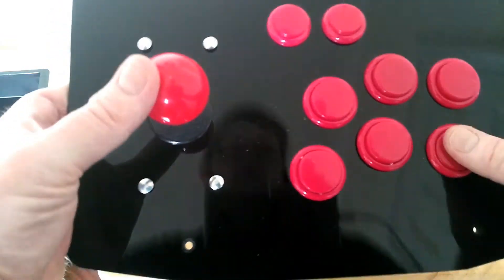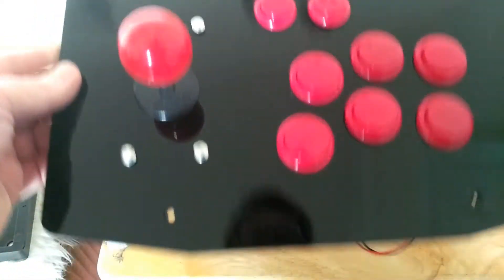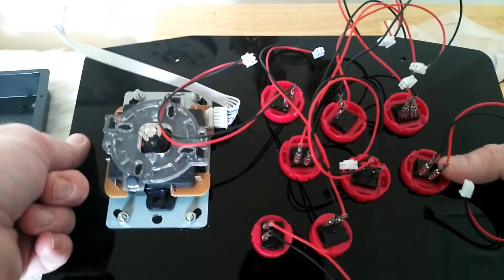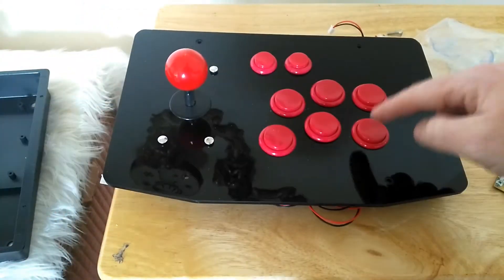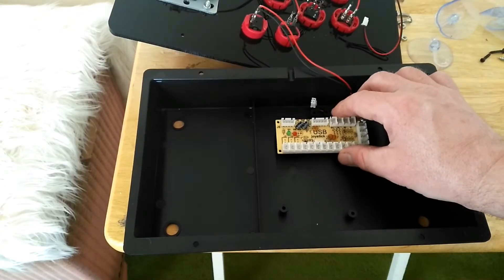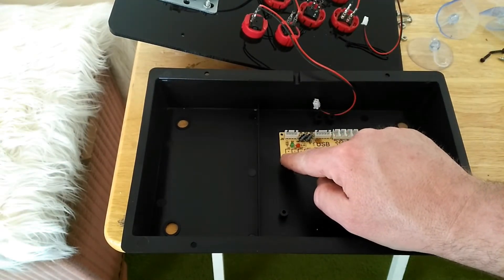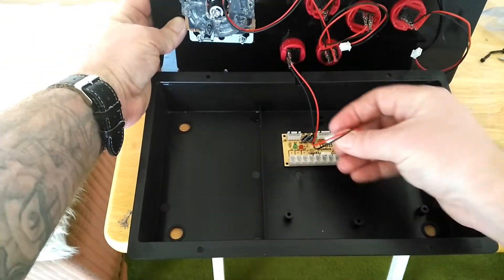So there's all the buttons in the case - yeah, it's not bad at all. There's the arcade stick bolted down. I don't know if these are going to be a bit loose, they're not great but I don't think they'll fall out or anything. They were a bugger to get out of my wooden monstrosity, I was really tight with them. Now to position the encoder inside the case - I'm going to leave the encoder loose in there until I get some Velcro, as there doesn't seem to be a place to mount it. Button one's here so I'll just go along and hook all the buttons up.